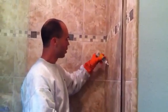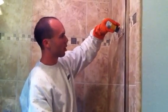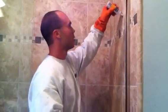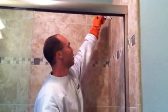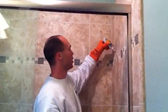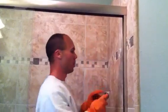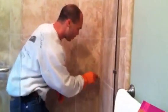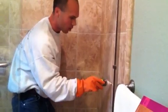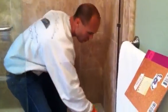I'm just going to cover up all of the grout lines, and I'm not worrying about it getting on the tile — it's okay if it gets on the tile. Porcelain tile doesn't need to be sealed, but it doesn't hurt it if the sealer gets on there. So we're going to go through all the grout joints and I'm going to do about the area of a wall — get all of the joints on this one wall.